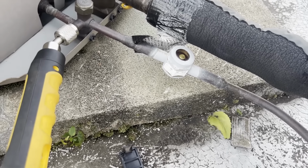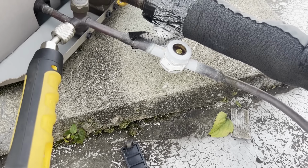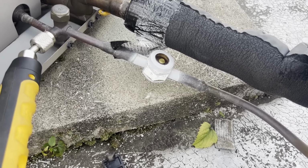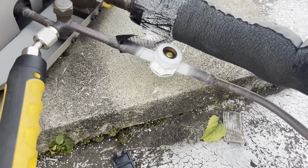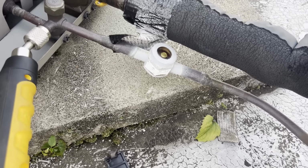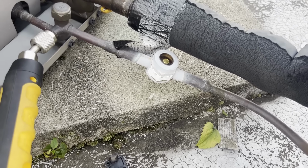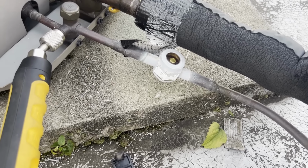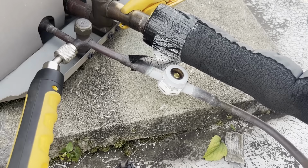So earlier I was saying it's a sight glass, but it's also a moisture indicator. It'll tell you if the system is dry or has some moisture content. Now, before proceeding, depending on the age of the sight glass, older sight glasses may not be sensitive enough to pick up wet conditions like moisture, especially with HFC refrigerants that contain POE oil.